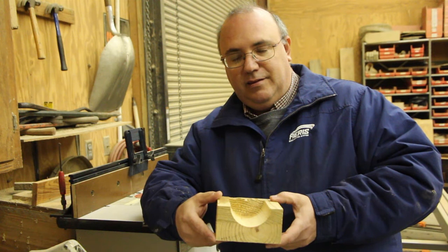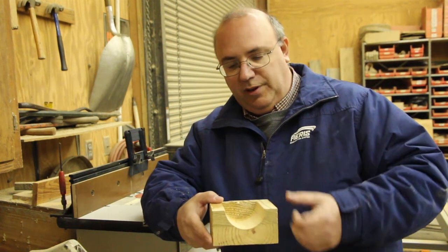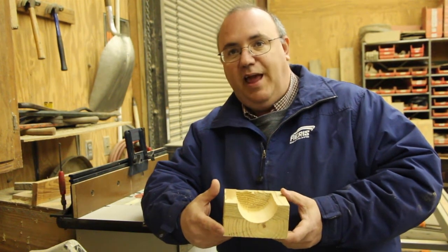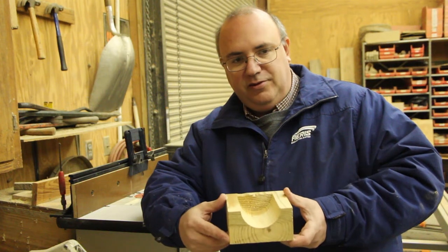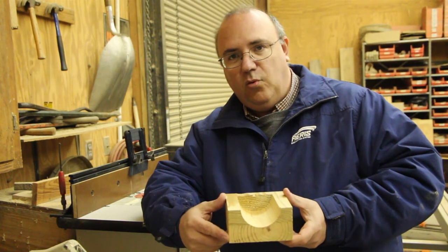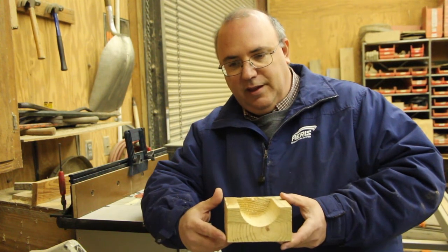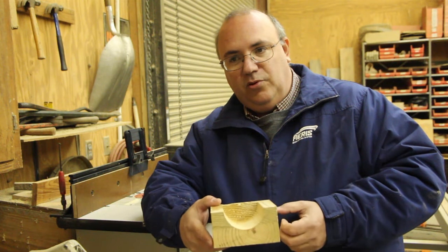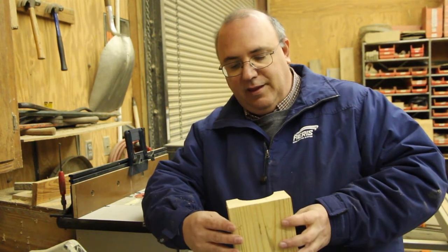Next I need to get the part for the shaft that will be going through the pulley — it's a smaller diameter, with a final diameter of about an inch and a half. The pattern I made was turned down to about an inch and a quarter diameter, just a tad over. That'll give me some room to remove some material, bore it out on the lathe, and be ready to go.